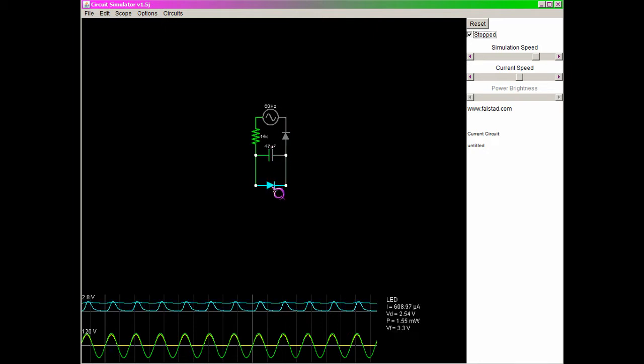And even though an LED is a diode, I've tried it before without the extra diode, and it kind of stopped working at a certain voltage. It had to have the full voltage in order to light, so it didn't work out too well.